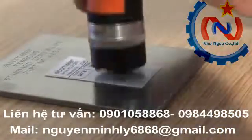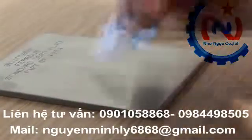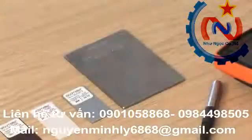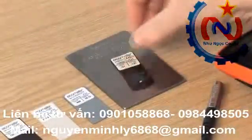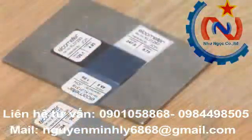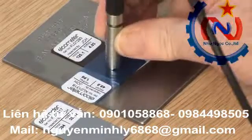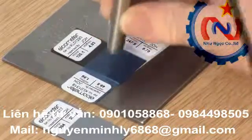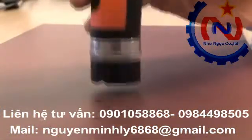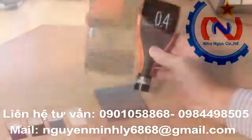2. When taking readings, avoid the foil label and place the probe in the center of the foil. 3. Use undamaged foils. It may be helpful to have spares. 4. When stacking foils to increase the foil thickness, carefully stack on the non-labeled surface. 5. Place the probe gently down perpendicularly, i.e. 90 degrees to the surface.